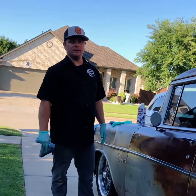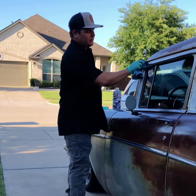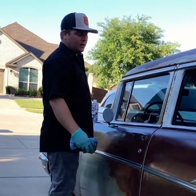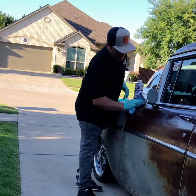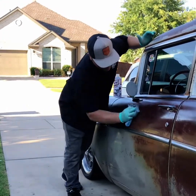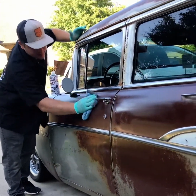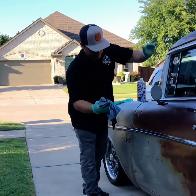So we've applied the Patina Sauce and waited right at about 20 minutes. What I like to do is start at the top and work my way down, doing one section at a time so you don't forget to wipe off a spot. It goes on kind of glossy — take a good microfiber and just start wiping, going back and forth. You want to get it wiping off as evenly as possible. Try not to miss any spots, then move to the next section and just flip your rag.